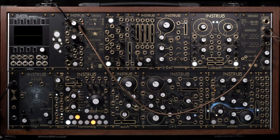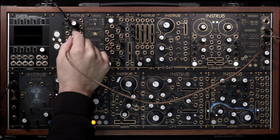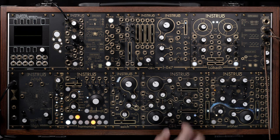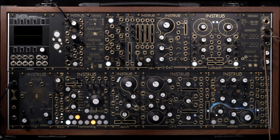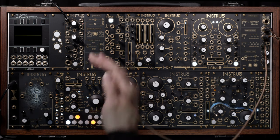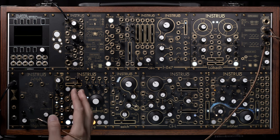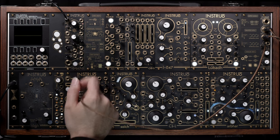Directly below we've got an enhanced channel. This is actually a broken-out, isolated implementation of the input stage I developed for both the Looper and the Arbor. On the Looper especially, it was designed to ensure that audio coming in never gets a chance to digitally clip — it will saturate in the analog domain long before it would clip digitally. There's a dynamic range compression effect, but the other goal was to mimic the response of recording to analog tape. This section is broken out specifically for modular level processing.